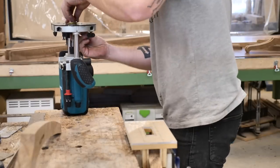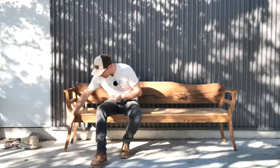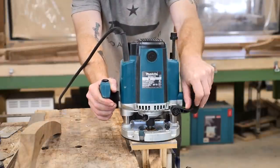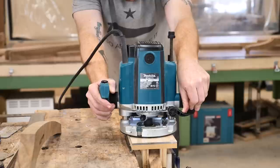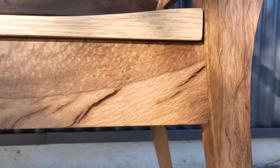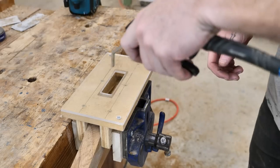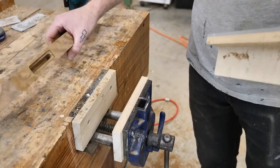Another really interesting and cool detail of this bench is this joint here where the apron connects to the leg. You've got a curve on the leg, so you don't have a flat surface for your shoulder to sit on. What you have to do is a housing mortise and tenon — that shoulder buries into this leg about this far, and that pocket is square and true, giving a place for that shoulder to seat up against. That allows you to put a shoulder up against a curved part. We've got a jig I made to do the mortise, and then we have to plane it down to fit into that pocket.